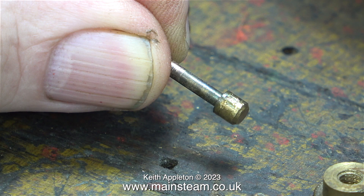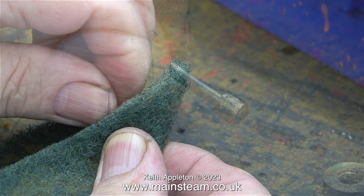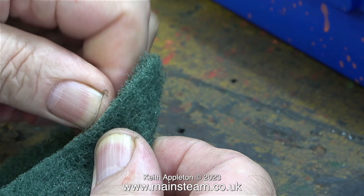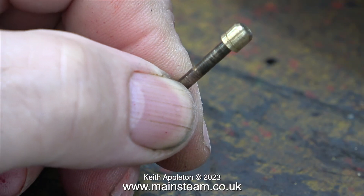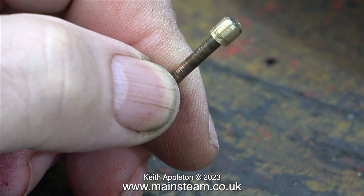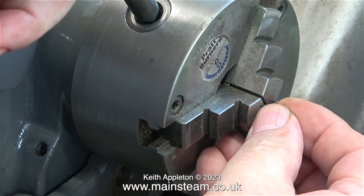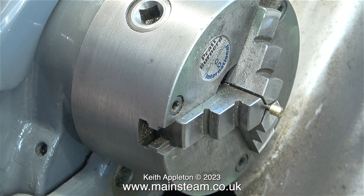Here I'm dismantling the safety valve to have a look at it — the centre part is a bit beaten up. I'm having a play with it and I think I'll make a new one, but first I'm going to experiment with this one. I've cleaned the part and now it looks better, but it needs a bit more work. Over to my Myford ML7R lathe — with the part in the chuck I'm going to clean it up using some wet-to-dry sandpaper.